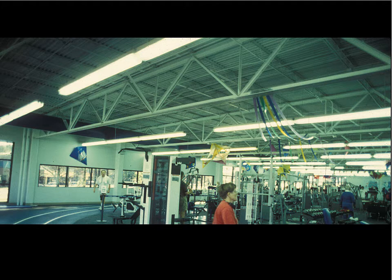Now, the mutually bracing sheets of material may not look exactly like sheets to you. For example, here we have a roof diaphragm, which is strong against forces in the horizontal direction. It's like a very deep beam, and that's a sheet of material that's very stable against horizontal movement. This truss now is kind of like a sheet of material. It's a sheet of material with giant holes in it, but it's very stable and very strong against vertical forces. So where this planar truss at the top chord meets this roof diaphragm, the two things are mutually bracing.